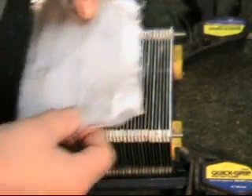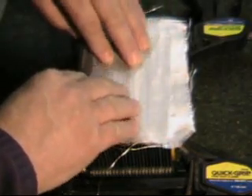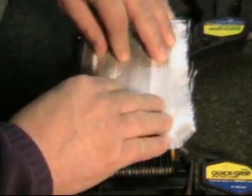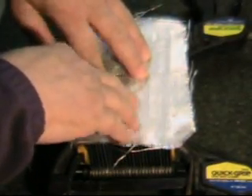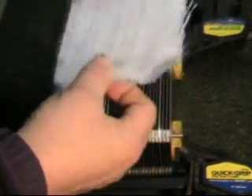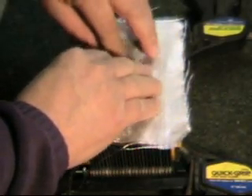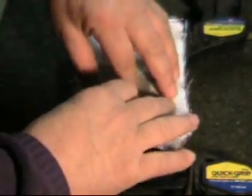Once I'm done with this, I'm going to do one side at a time — lay the glass and the resin on there, push it down in between the plates just a little bit to get it to seal. I'm going to turn this over, put it on some wax paper and let it set up. I don't want any excess resin running down in between the plates, so it'll just be damp enough — squeegee it off a little bit so it'll stick and form, then wrap it down around the sides.